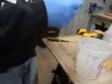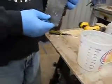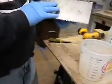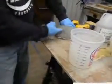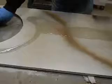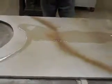This is a 1/8 by 1/8 square notch trowel, and as you can see, I've used it with this epoxy a lot. When you're done with it, you set it like this so the stuff will run off, which keeps the notches clean. Now you pour this on. And that's probably enough, but I have that other one to do, so I'm going to set that aside.